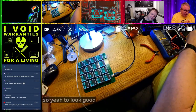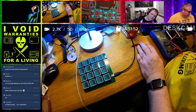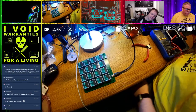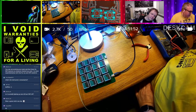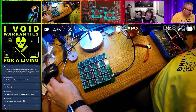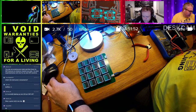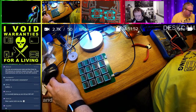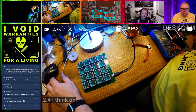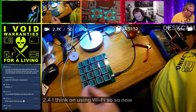So this is actually working, and this is as far as I got it. It was working on the initial setting, and the only thing that I did was, what's the total power consumption is what Arun is asking. I put a USB dongle in the middle, and it was using only the LEDs, I think 1.8 amp, and 2.4 I think using Wi-Fi as well. I'm quite happy with the result, how it looks.